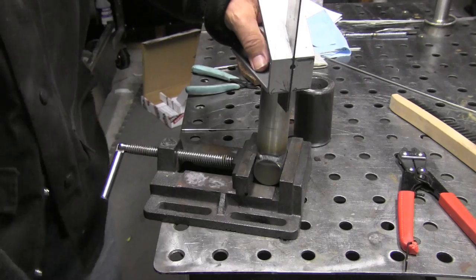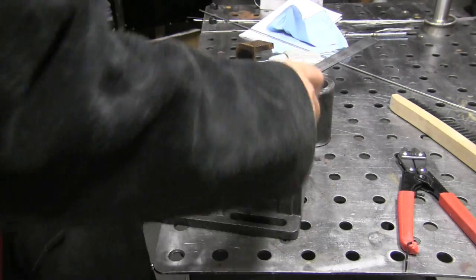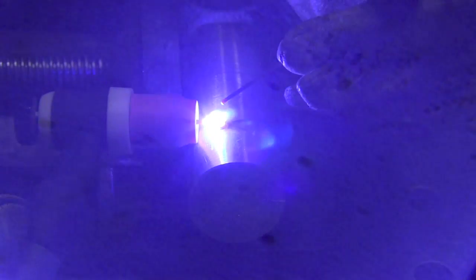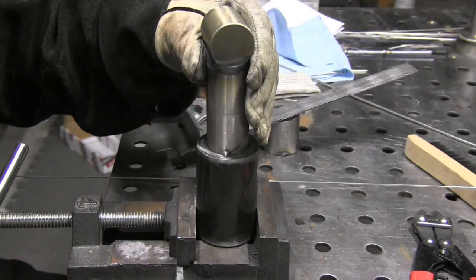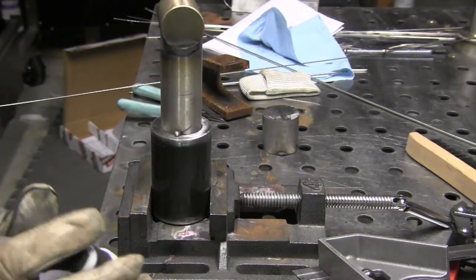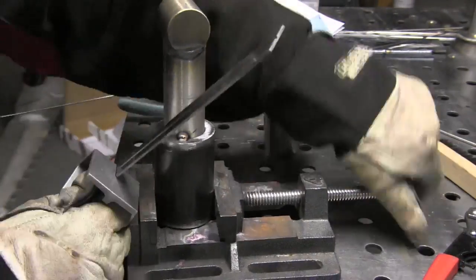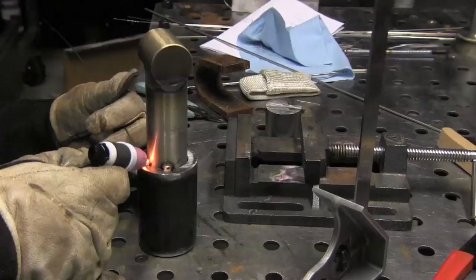That's two passes on there. It takes a lot of weld to fill in these little gaps because I don't have the round stock coped or anything, but that's okay — it's just like a bevel and it's getting plenty of weld in there. What I'm doing here is putting a little bump on the piece because I want it to engage in the carbon steel tubing there one inch, and that's just a really quick, easy way to make a stop. We'll get four tacks on this thing and square it up, make sure it's not too bad off, and then weld it out.